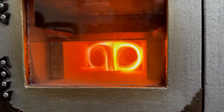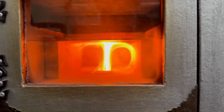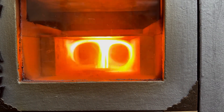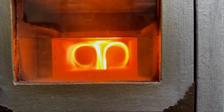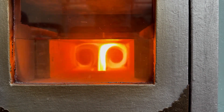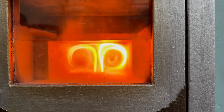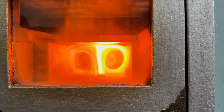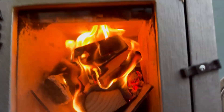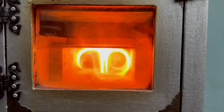It's starting to get a bit of flashing — not too bad at the moment. It's growing. We're definitely getting some flashing now. There's no smoke coming out of the chimney whatsoever — the fire is still burning off all the smoke — but we are getting some escaping fuel. Moving back again, it's getting seriously hot, and the wood is well and truly on fire. We're most definitely getting over-fueling now.